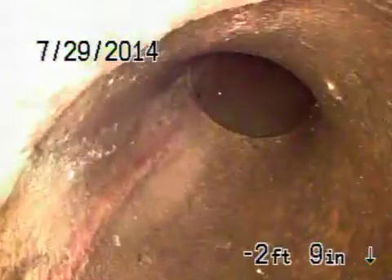If you've got to replace everything as we come back, this is all six-inch clay which looks like it's in pretty good condition. Coming underneath the street, nice and clean. We're gonna come onto the property line here shortly — it's gonna transition from six-inch clay to four-inch cast iron. That's approximately five feet deep.